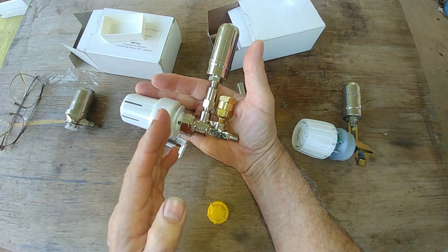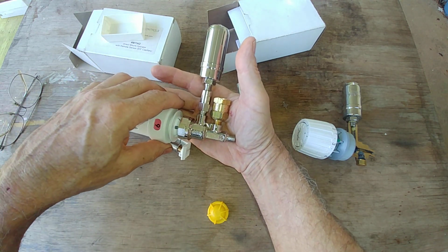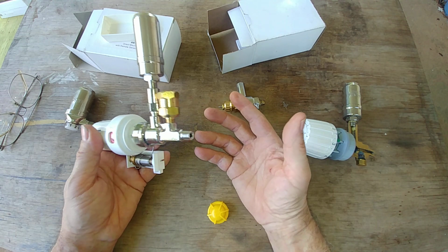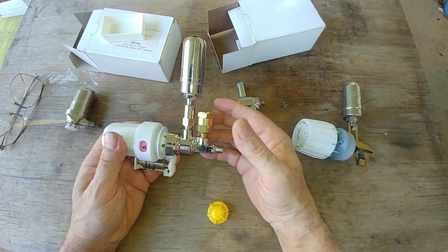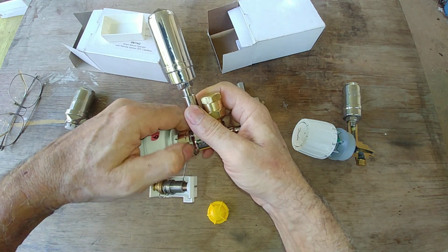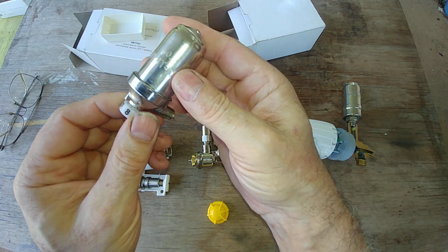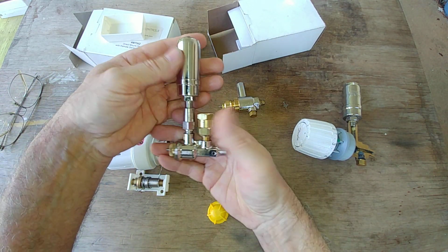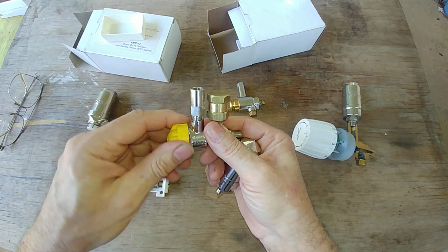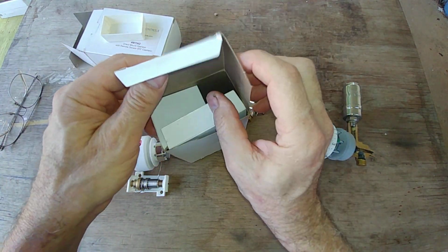As you can see, also you have to have a fairly large clearance to be able to install this and make it work. So again, it depends on your situation. You've got to understand how your boiler is working, and whether or not you absolutely need this or can use an easily adjustable vent, rather than go with this high-tech solution. But when these work, they work. To kind of understand their principles of operation and their limitations.